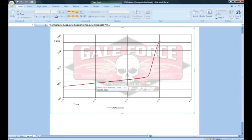You can move the cursor wherever you want to look — a sixteenth, or wherever. Put it to your peak where it gets on the bump. We're showing about 2 and 5 eighths on our air gap before it starts touching the bump, with a total load of 1,160 pounds. So at 2 and 5 eighths, we're starting to get on our bump stop on our shock. And our final load in that last little bit of travel — 3 eighths of an inch — we're showing 2,271 pounds.